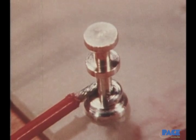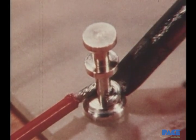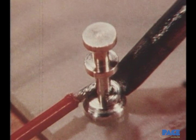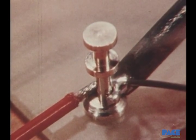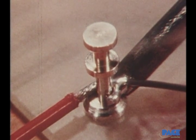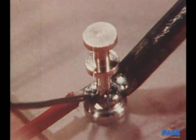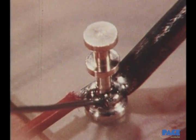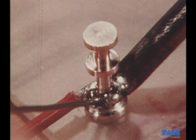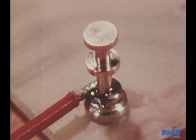There are four basic steps in soldering. Step one: put the iron at the point of maximum thermal mass. Step two: a solder bridge is made to increase the thermal linkage between tip and work. Step three: solder is applied on the opposite side from the iron — it's painted on and then removed while the iron is still there. Step four: the iron is withdrawn with a wiping motion.